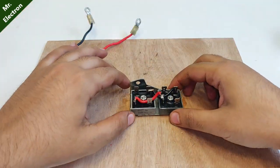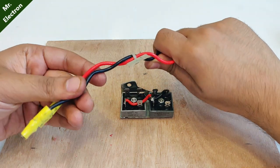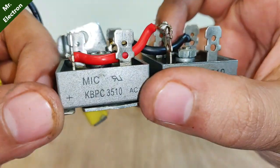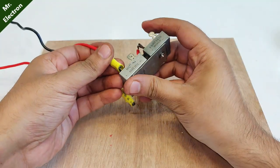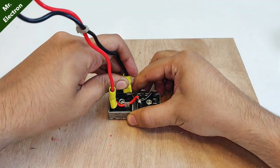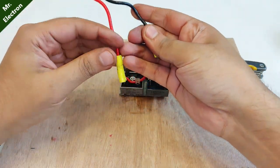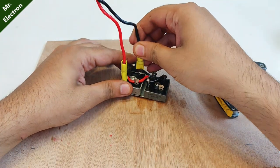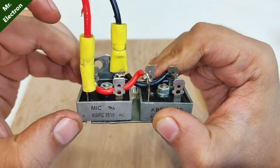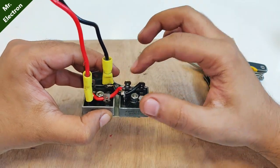The soldering part is over. There are three input cables for three-phase and two output cables for DC. I'm choosing two high-current wires for the DC output — the common positive and negative. The red wire denotes the final positive output and the diagonal opposite terminal denotes the final negative. The outputs from both rectifiers are connected together with jumper cables.